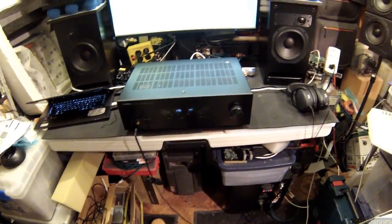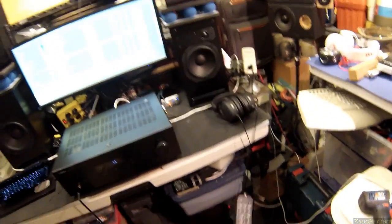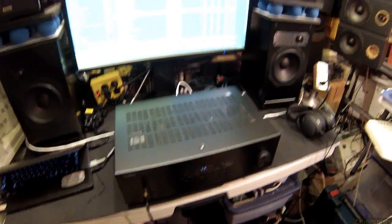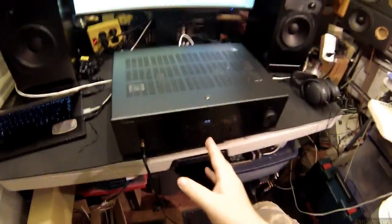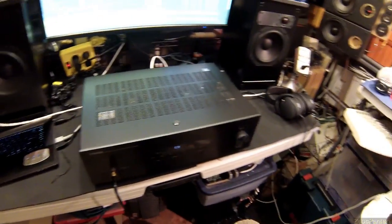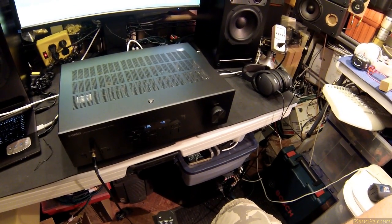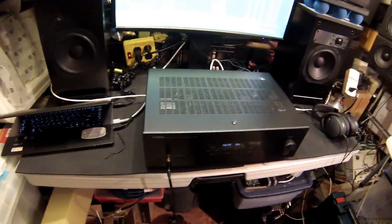Yeah. Definitely not as efficient. I'm pretty sure my SA50 at loud uses about 8 or 10 watts. So this is 70 watts at loud. So if you're a green freak, you want to stick to T-amps. If you don't give a shit about trees or the environment, you can look at this. Just don't leave it running all day. I mean, at like this volume, it's 17. At normal volume, it's 20, 22. It's pretty much an exponential gain once you start really hammering it.